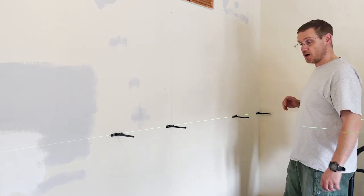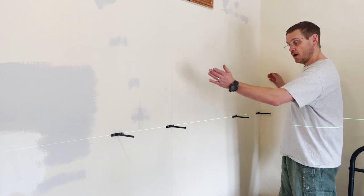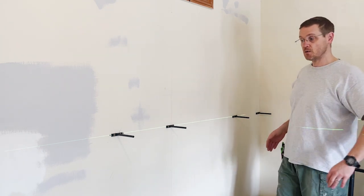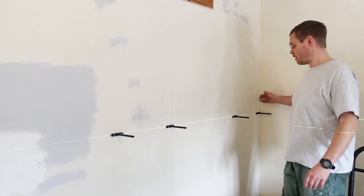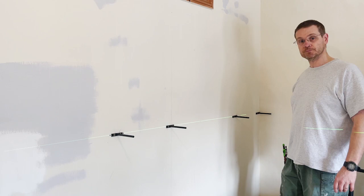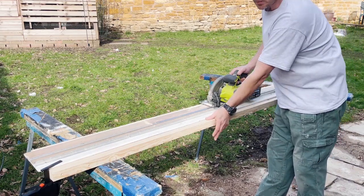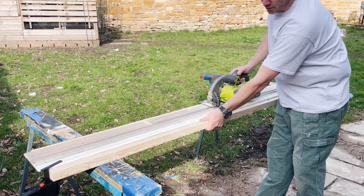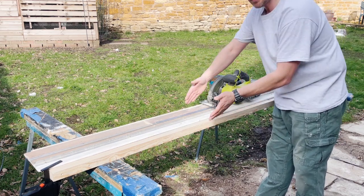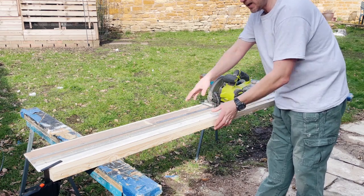What I'm going to do is make the shelf from a piece of wood, cut it to size, prep it, then lay it on top and mark the hole centres so I don't have to measure - I'll get it absolutely right just by laying it on. This is the piece of wood I'm using: a new scaffold plank. It's a bit wide but nice and thick, so I'm ripping it down to 200 wide, which is enough for a book plus about an inch.